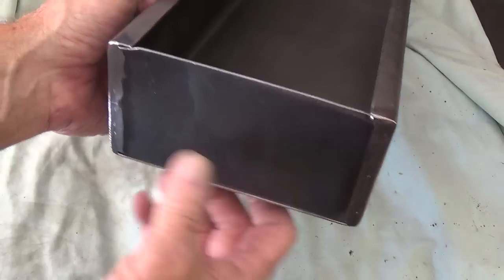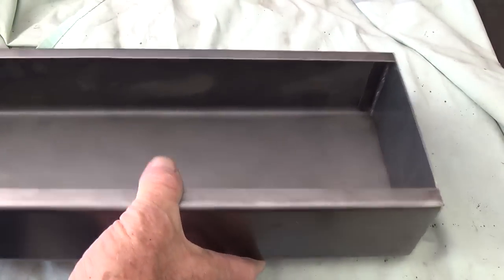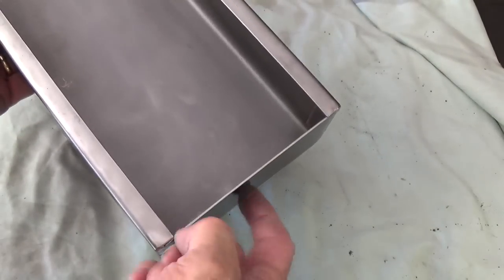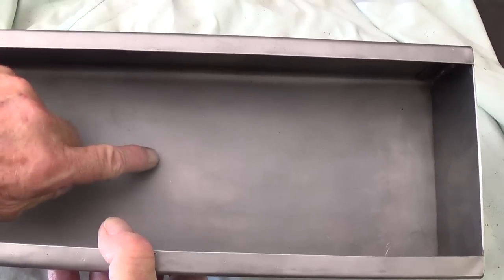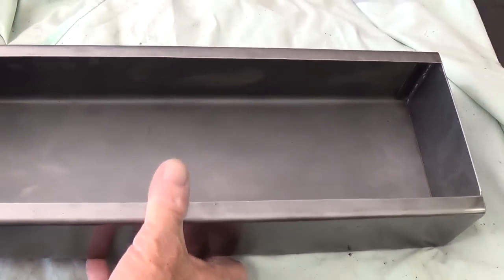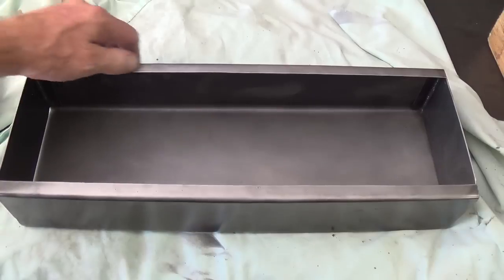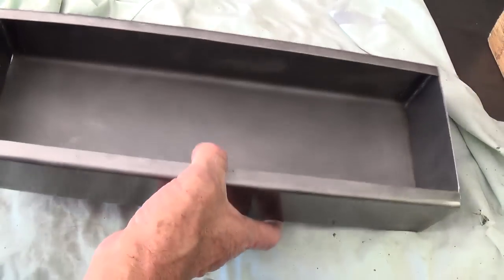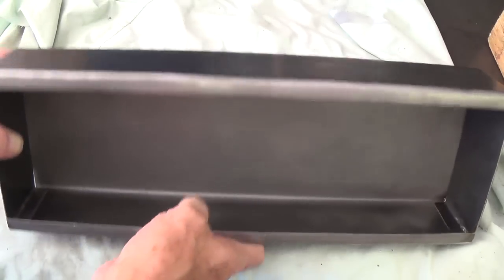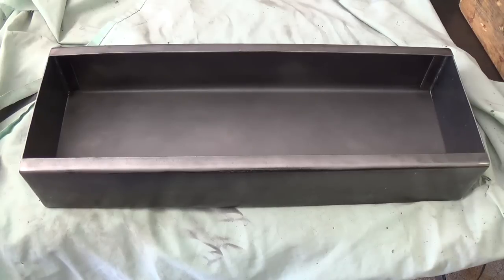Here's this end piece with the welding done along the edges — as you can see, it's immaculate inside. That's about it for our chassis. It is rock solid and looks pretty darn good. I've started removing some of the bluing in here because I was afraid it might interfere with my soldering and grounding. I've got a little cosmetic work to do, and then it's time to start cutting the holes and installing all the components. But first I'm going to build the cabinet around this so I know it fits perfectly, and I'll have the cabinet to check clearance issues, know exactly where to place my controls on top, my tubes on the bottom, and where my power transformer can go up in the corner.